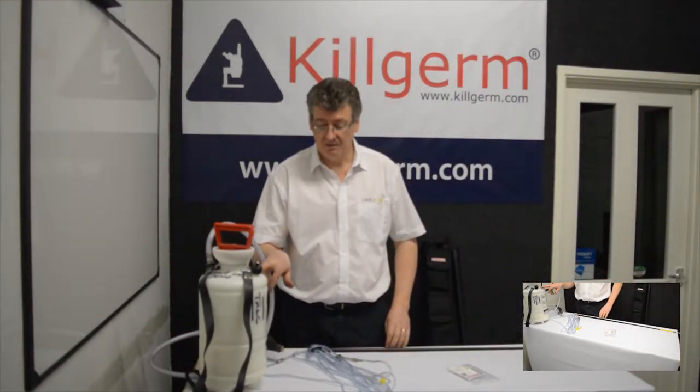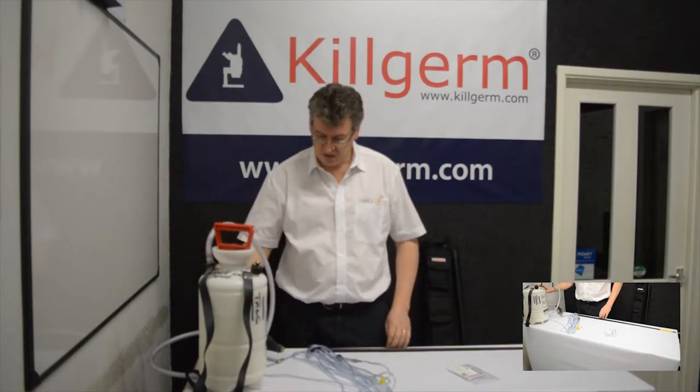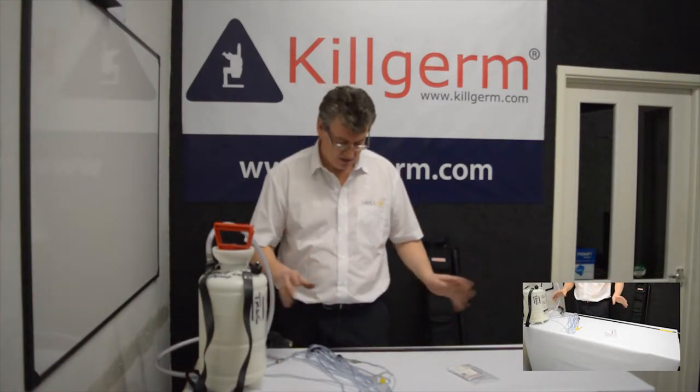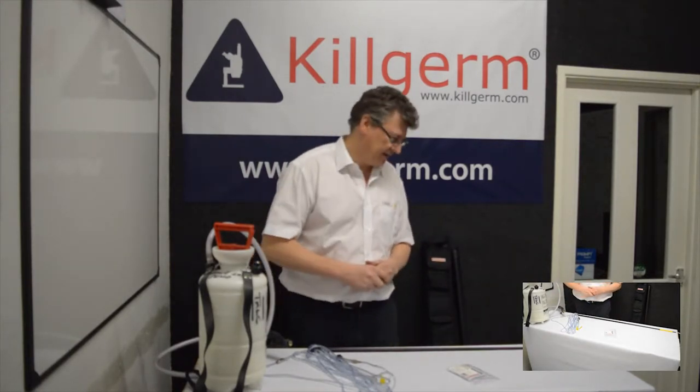Also at the end of the season, we will advise emptying the DR5, pressurising it with ordinary air, just discharge out through the system — just a blow clean — so that when you are leaving the gear sitting for any period of time, moisture ingress that will cause clogging is less likely to happen.